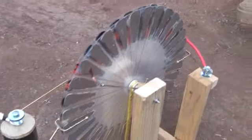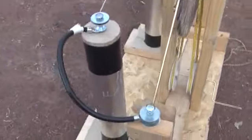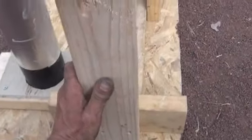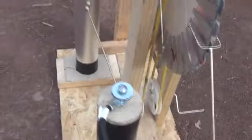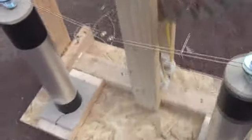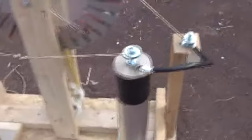There's just the simplest way to build a Wimshurst electrostatic generator. It's all made out of wood, this whole platform. If I grab this one side here, you'll notice it's all screwed together — it's all one platform so you can move it around and nothing gets jostled. Because the last thing you need is to try to deal with these two large capacitors in any other way.